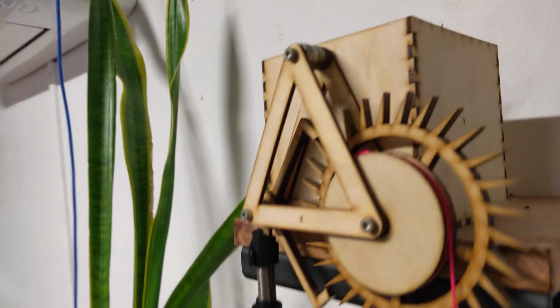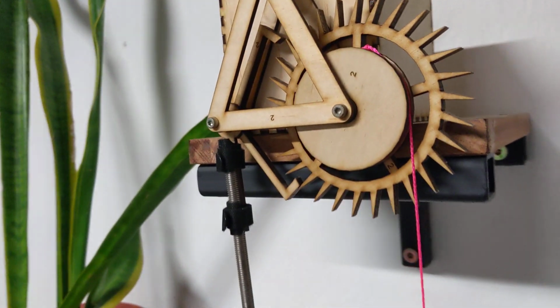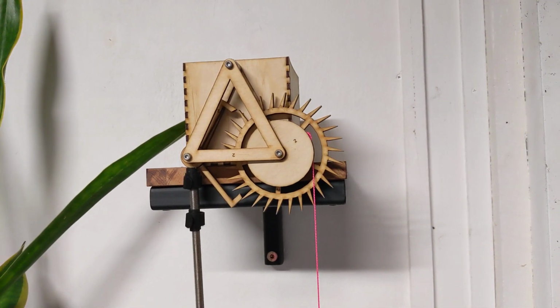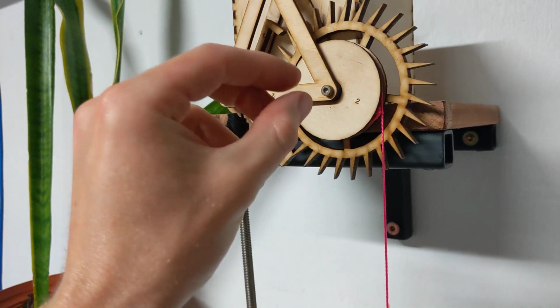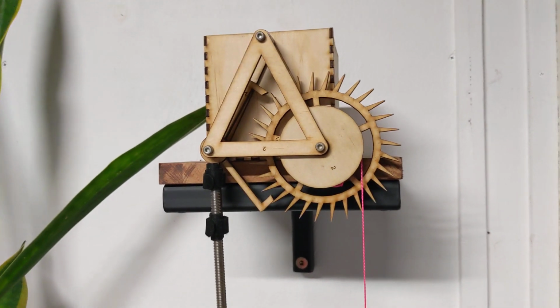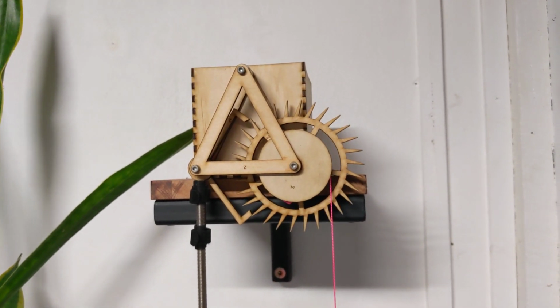So I've got some bolts and bearings and such, but predominantly I want to try and keep it as laser cut as possible, because I could turn up concentric shafts on the lathe that pass the rotation through to the hands that you can just pop on the front. That'd be trivial, but it's not so easy to make those things out of laser cut wood.